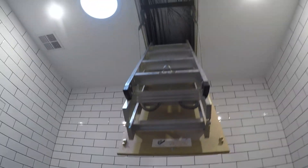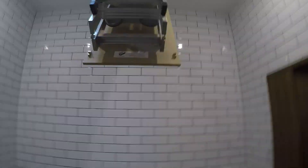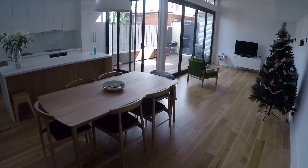It's critical that when you install an attic ladder like this, you make sure you have the clearance across the ceiling and down the walls. We actually had to move this back — we had it centered but had to shift it back 150mm just to make sure we had enough clearance for the ladder to open and allow someone to walk up from the hallway, giving us maximum ability to get as much as we can up there.